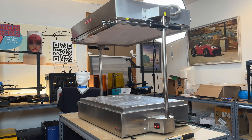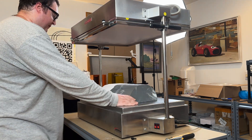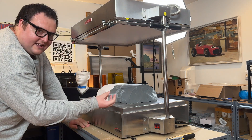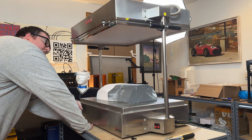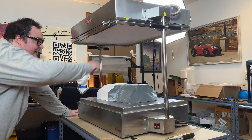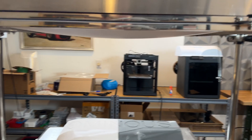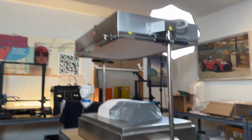This is kind of where you have to get a feel for what's going on. The plastic will begin to droop. If the plastic doesn't get hot enough, it won't be flexible enough to form over your shape. If the plastic gets too hot, you risk the vacuum pressure just blowing a hole in it because it gets too thin, and the air being sucked through is too strong for the plastic to defend against. So basically the plastic's going to droop — you can already see it's a bit flexible — and we're going to wait until it droops to about right here, because with a larger buck it does need to be a bit more flexible.